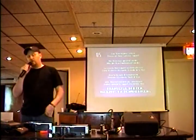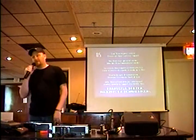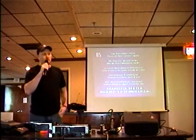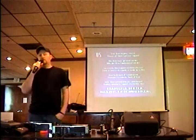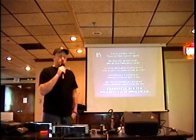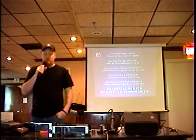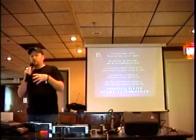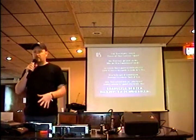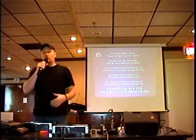Other than maybe a 1.6 Xbox. The 1.6 Xbox does not have a flashable BIOS. I don't know why it took Microsoft so long, 7 versions, to put a chip on there that's not flashable. But that may be a case where you have to have a mod chip. There's no way to do a TSOP flash on it, so that method's not going to work. Your options are a soft mod exploit or a mod chip.